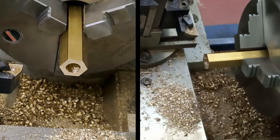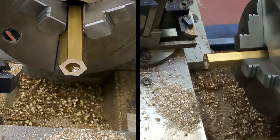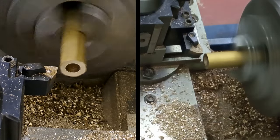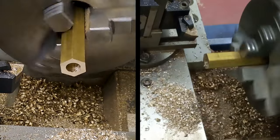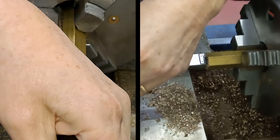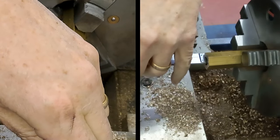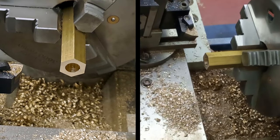Grip. 19.8. Another little bit off. Right, so we had to take 0.3 off, which I'm very close to. Like I said before, the drawing states within 0.2 of a millimeter is close enough. So let's remeasure that. And there we go. Pop that up. We are at, yeah, close enough. Right, let's get this drill out of the chuck, and get the tap in,